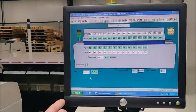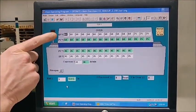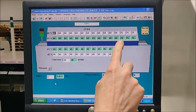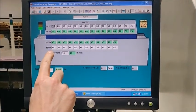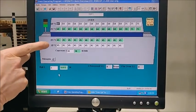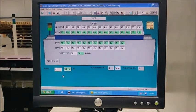The question was top and bottom heat control. As you can see, we have top set points and present values for just the top zones. You have 12 heated zones, 3 cool, and then you have 12 separate independently controlled bottom heat zones. You can see we've set the top at 60°C, achieved 60°C; here we've set it at 45, achieved 45. Completely independent top to bottom controls.